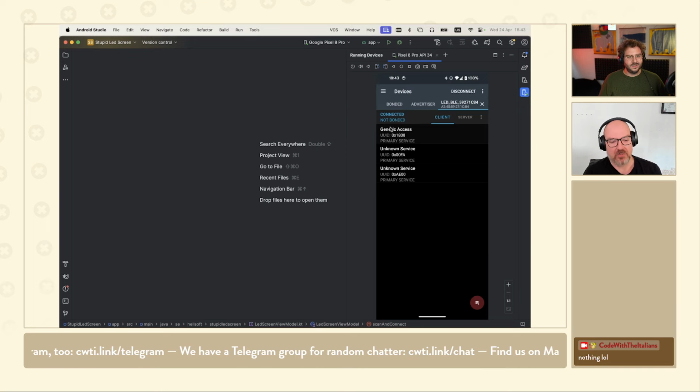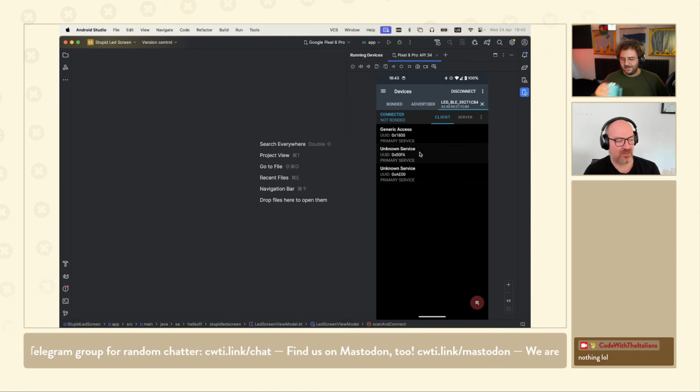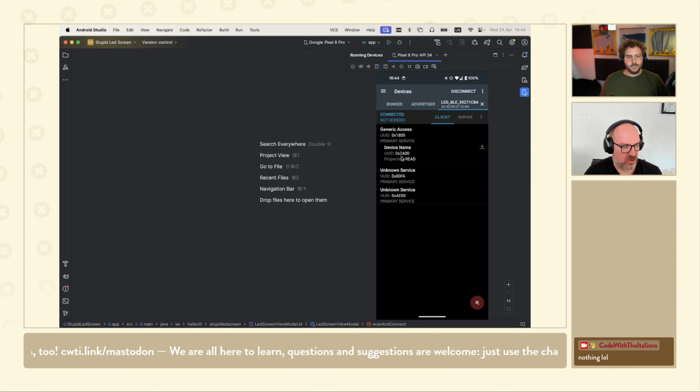So anyway, we're using Bluetooth Low Energy with the protocol on top of that called GATT, Generic Attribute Profile, because abbreviations are difficult. So it's GATT for those following at home. It's structured so that you connect to a peripheral and get a list of services once connected. Services are basically logical groupings, so they don't carry any functionality. Underneath the services, you have characteristics. This is a characteristic, and here you see the UUID. It's not a UUID that you would recognize as a UUID. So what is it? It's a short UUID that we use in Bluetooth. There's a predefined set, and we use just part of it.